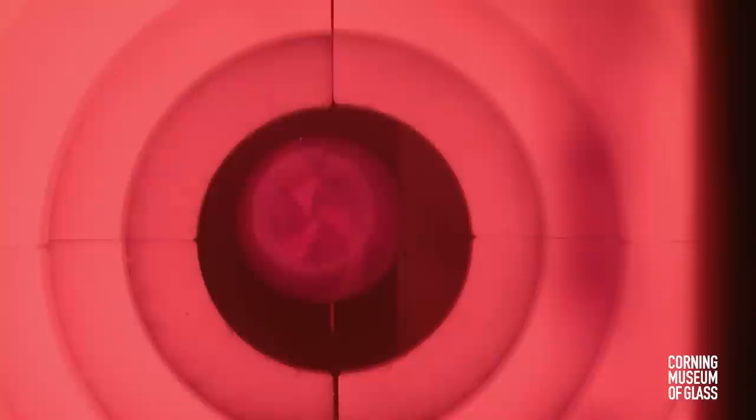Now, this is a very specific heat. Ian's not all the way in the doors at the moment. You can see he's most of the way in, but he's left the back section out of the oven doors, and this is giving a nice spot heat to one half of that bubble, probably two-thirds of it. This is a good indicator to me he's probably going to begin stretching this form now, and he wants to leave that top section bulbous. If he heated the whole thing and stretched it, it would turn into a long, skinny tube, but he wants to leave a bulbous section up there and have it taper down, so that has a lot to do with the types of heat that you take before you start really committing to elongating it.